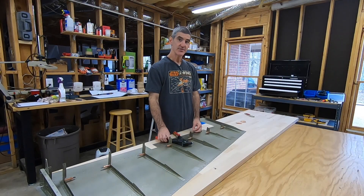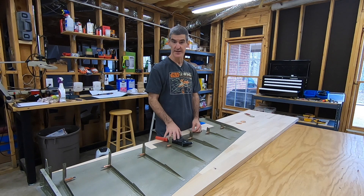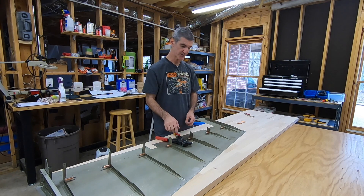This is the last step before using the tank sealant on the trailing edge. Before that, I'm going to rivet the shear clips here to the stiffeners on the right rudder skin.